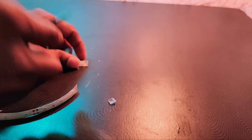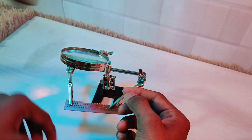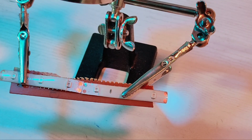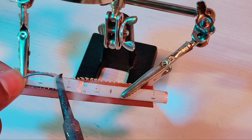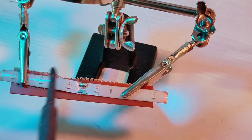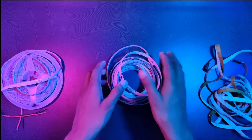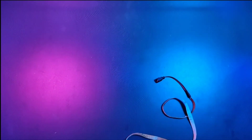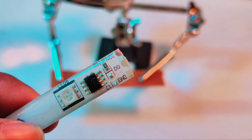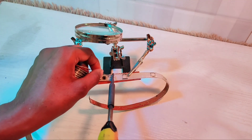Remove the waterproof layer. How to attach two LED strips? Take 2 LED strips, connect them positive to positive and negative to negative pins. Then using soldering, solder them together. For my project, I am using this 3-pin LED strip. The 3-pin LED strip contains VCC, Data, and Ground pin. Properly solder them using soldering techniques.